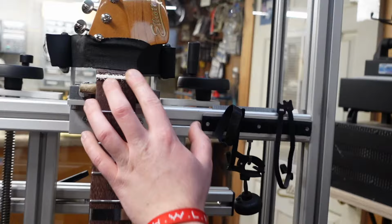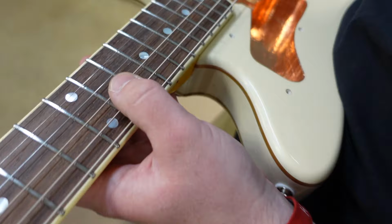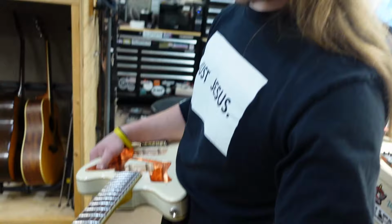So once it comes out of the Plek machine, Colby, what happens? It cuts the nut one time, and that's when we can string it up and get it ready for fret dressing, which has already been done. The Plek machine fret dresses? Yep, it's got a cutter head that rolls over the frets and cuts them. And while it's unstrung, after it cuts the frets, it'll cut the nut one more time down to the right nut action.